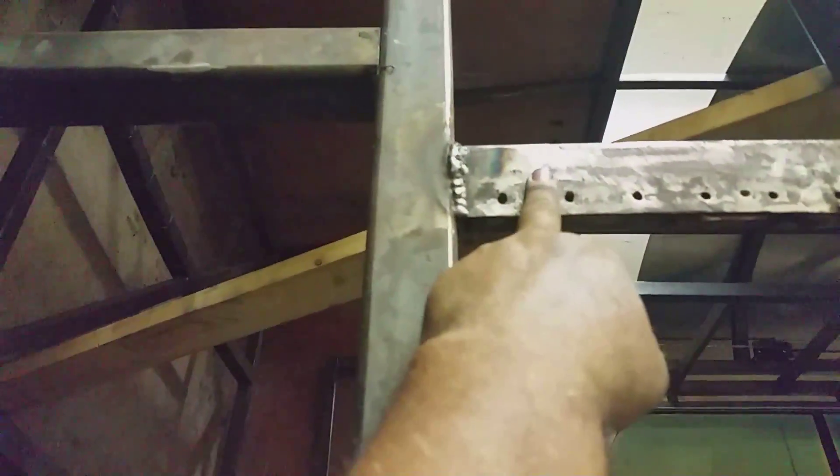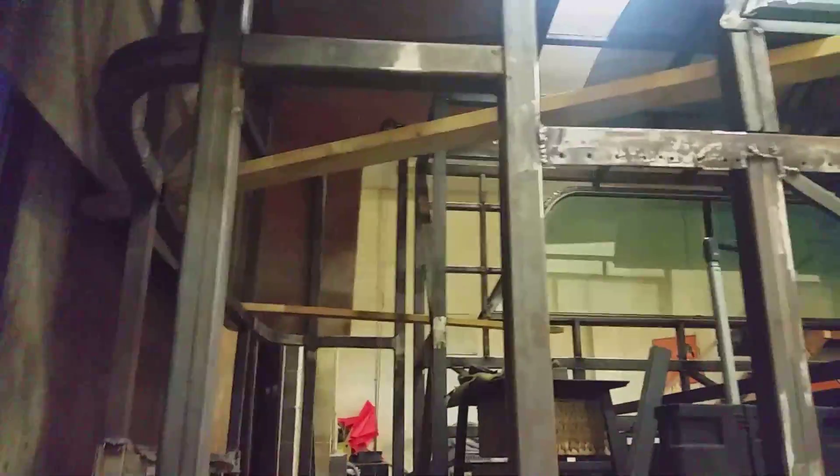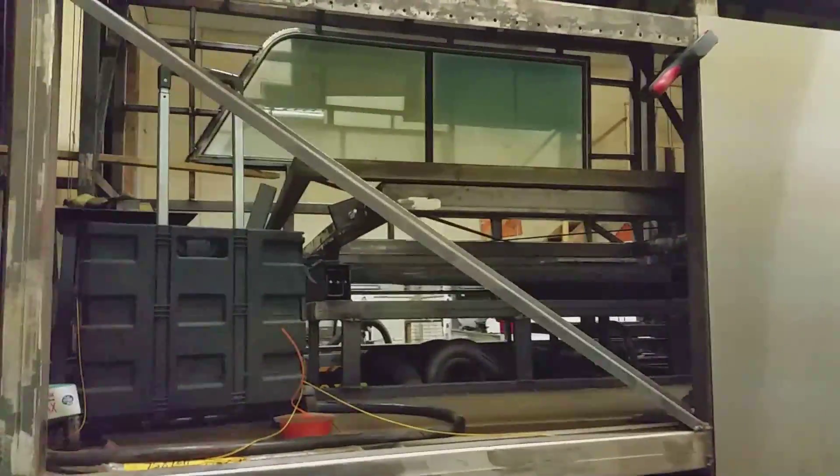Because I went up to 12 inches, the cap isn't long enough to come down to this point here. The aluminum will come to here, up to the next one, and then around the back. That's why I couldn't get another one sheared at 33 — it wouldn't fit. So I'll make a template, form it around the back, and it'll go up to this point and actually go under this one. I'm going to cleco everything onto the whole side first, then come back and start riveting — though I may modify that plan.